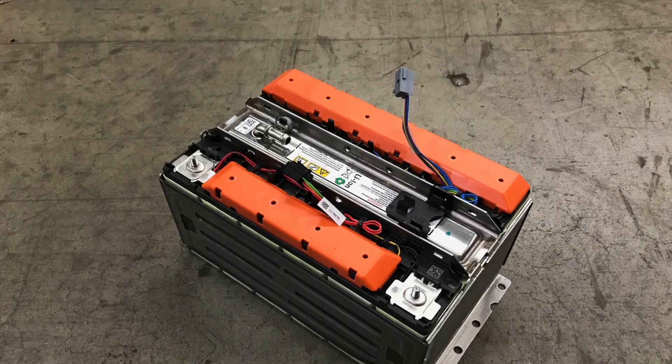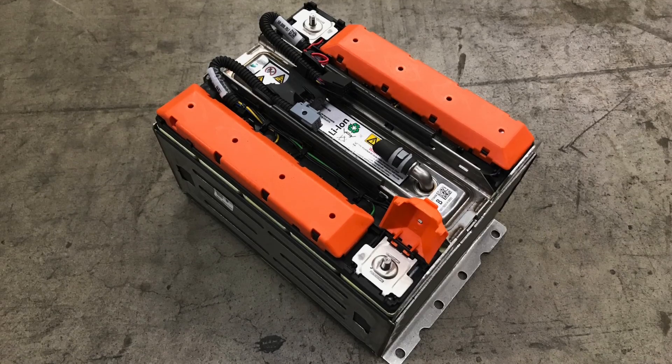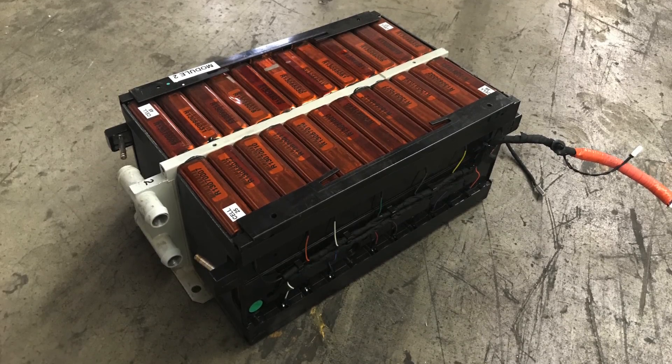So let's talk about these batteries. What kind of batteries are these? Well, these are used recycled lithium-ion batteries. They're nickel manganese cobalt chemistry, to be more exact. These are going to be selling at $150 a kilowatt hour. These come from automotive applications, so they are very powerful batteries — they're like 10C batteries, power cells. They can put out a ton of power, so they will absolutely have no problem pushing power in a Powerwall application.